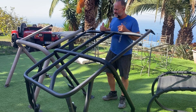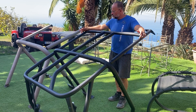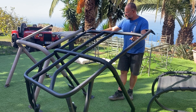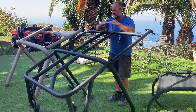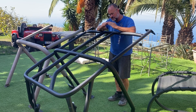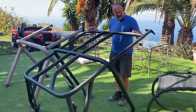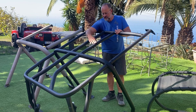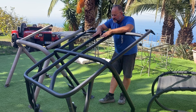What I did is I put a front tie-in and a back tie-in in. The front tie-in consists of this spreader bar that joins onto the pillar bars. I then put a kink into it on the sides because the center section has a kink as well - the stock bar has a center kink to make it stronger, so if the Jeep ever rolls over it's more difficult to push past, making it stronger. I used that same technique on the spreader bar and also on these bars going across - they also have a slight kink in them.